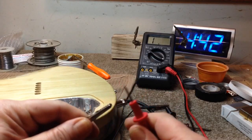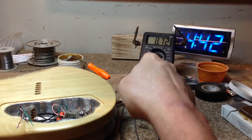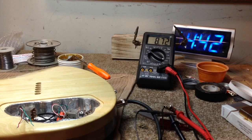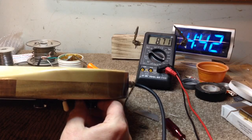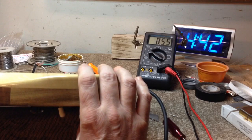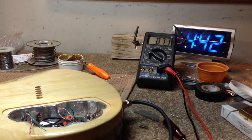Connect the other one to the red. The reading I'm getting is my bridge humbucker. Now if I pull the push-pull pot, that's single coil, and that's the full humbucker. Hey, it works — who knew! I'll be back once I get the second one wired up.